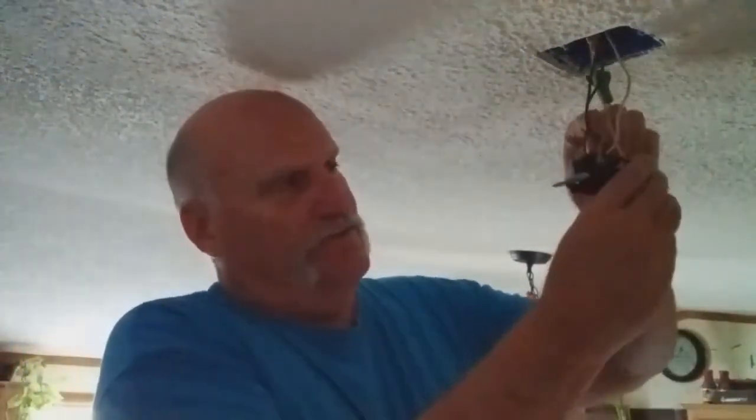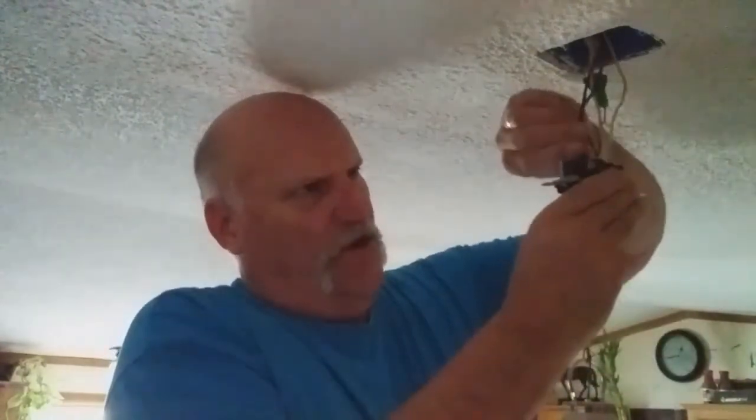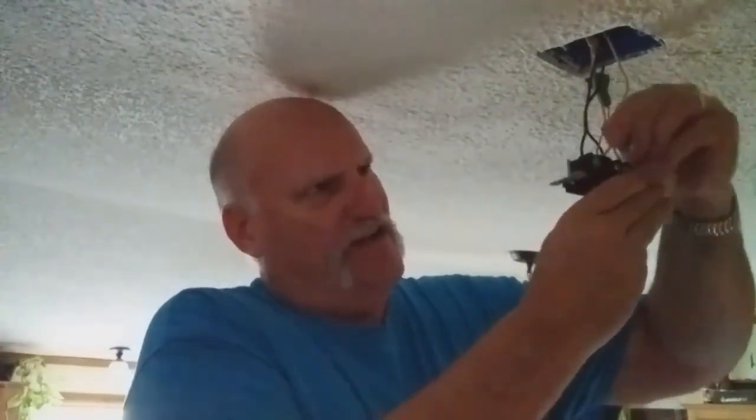Well, my friends, I got all the wires in there. Now you're probably wondering, how do I know? Well, you can give them a little pull. If they come out of there, then you know you don't have them in there. Okay? So what I'm going to do now is go back down off the ladder a little bit, push these wires around and put them up in the box, and then we'll go turn the power back on, and then we'll check the power circuitry with this tool right here. It's a ground fault interrupter, but we want to make sure that it's wired right and it's got power through it.